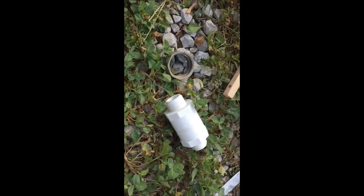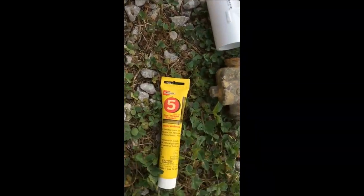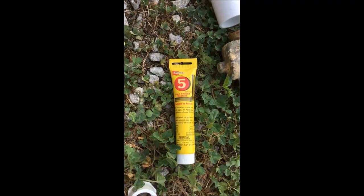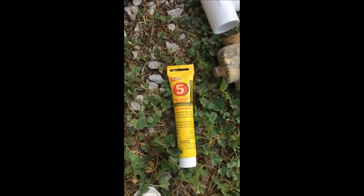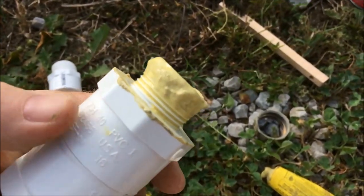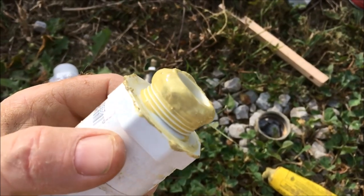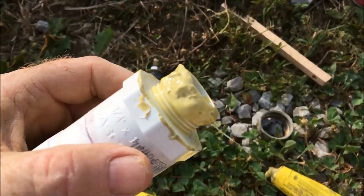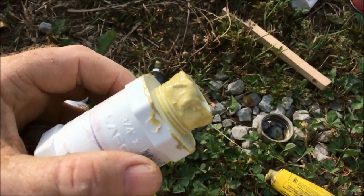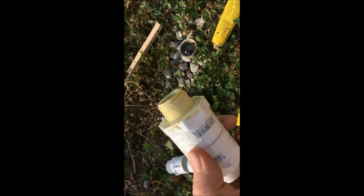Time to put on some of my threaded parts — I've got that glued together. I'm going to use Yellow Number 5, the best pipe joint compound ever — it does gas, water, other gases, it's great. When you put Yellow Number 5 on there you want to make sure the stuff coming out looks like thin play-doh, not just liquid. That liquid stuff is like when a mustard jar pees on you when you didn't shake it up correctly. You put it on so it goes down in the threads, wipe it off the outside threads — there you go, all ready to screw together.